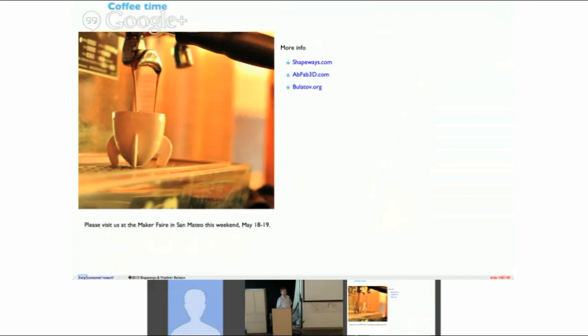Right, but if I print a largish stainless steel thing and then have it filled with bronze, can I count on it? It is people who are actually running the process, and it is many years of research, they are trying to take it into account. The reality is, sometimes the model breaks. Maybe somebody just slams the door next to the printer and some layer separation happens. They break with no reason. Sometimes they break during this cooling, heating, and annealing with no reason. It is still a little bit of black magic.